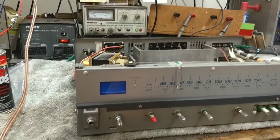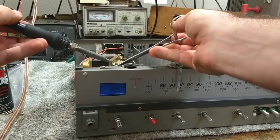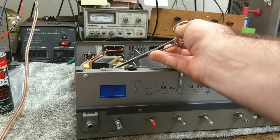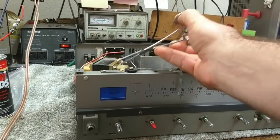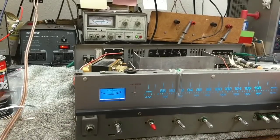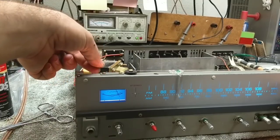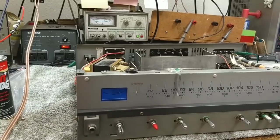So I'm going to see if by pulling on this lead while I'm tuning, the meter deflects. See that? And if I let go of it, it doesn't tune back. So we need to yank on this a little bit and get the bearing to reseat. The easiest way to do that — obviously remove power first — we're going to get a soldering iron and heat up that lead as we pull on it. Now we can see the meter's reset. I'm going to hold it back while it cools and then pull on it a bit. Now let's turn it on and see if that helped any. It did not. Now if I pull back on the left one, it works. And then it freezes up. So let's try the same method with the left one.